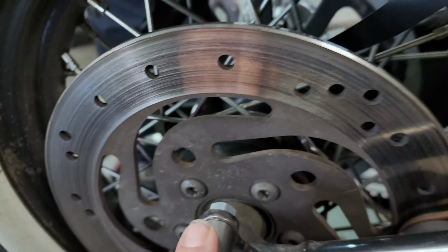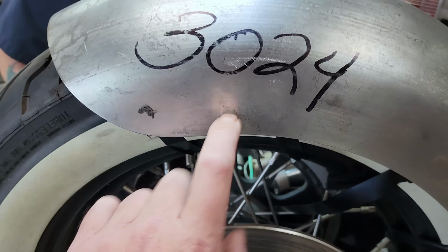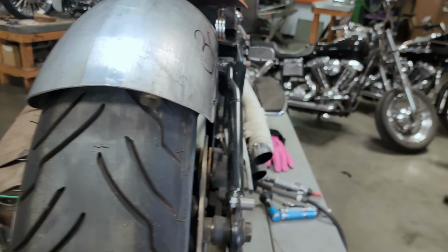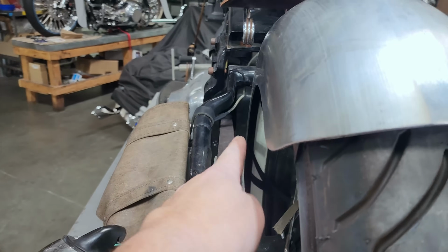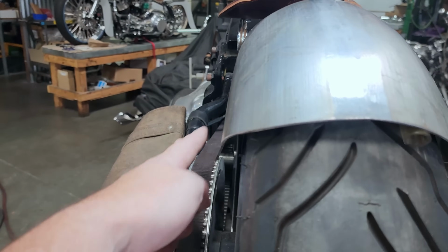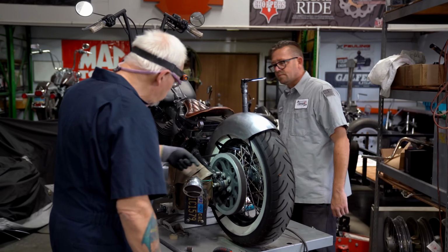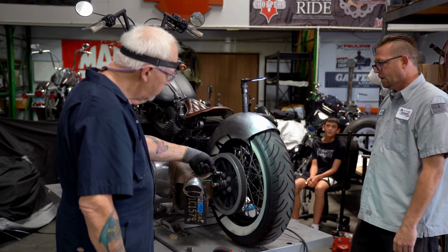So these bolted there, and we find out what angle we're going to want them at. Bolt another little bung to the fender, and we'll take some bar and bend it on our angles. This one obviously has to have a pretty big dog leg coming over and then up. I mean, it won't be sharp, it'll just be smooth. Well, what angle do you want? Classically, it's 90 degrees to the swing arm. Right. Know what I mean? Yep.